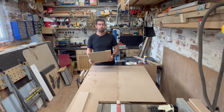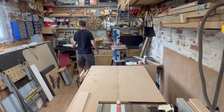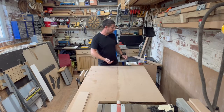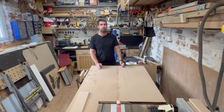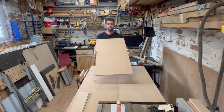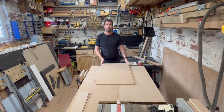Recently I've found an easier way, which is probably easier for the beginner or amateur woodworker. So if you haven't got a workshop full of nice fancy equipment, or even if you have and you're just starting up, the easiest way to make a frame and panel door or a shaker style door is to start off with a door blank. With the door blank, this is the correct size for the door and it's cut perfectly square.